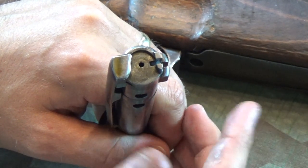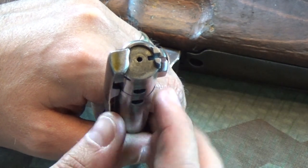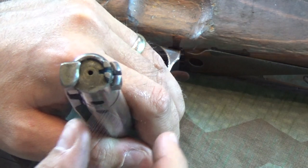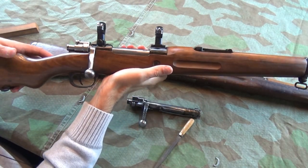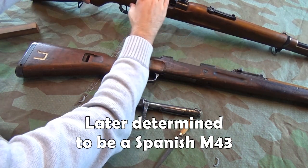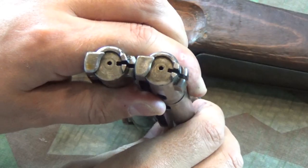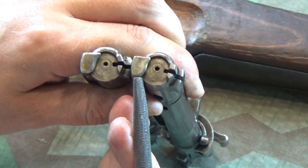Something the Yugoslavs did when they refurbished German-made Kar 98ks into M48s was they improved and standardized the chamfer bevel on the extractor. In the meantime I've acquired this post-war commercial Mauser which appears to be Czech-made, so if we compare now with one that is as it should be...